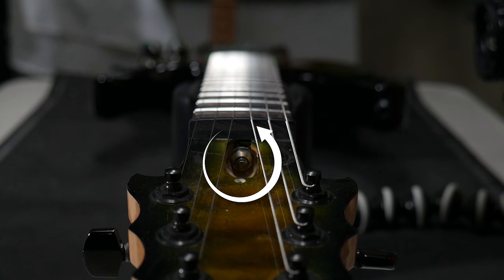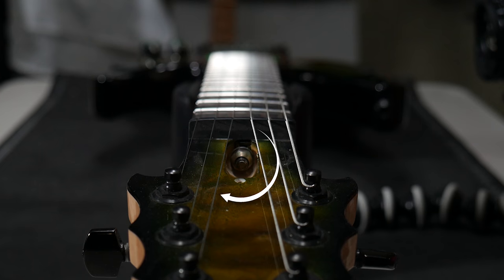All I really need to do is relieve tension, and it's as simple as turning this hex nut. To relieve tension, you go counterclockwise — lefty loosey, as they say. If you want to add tension, you go clockwise — righty tighty. So in this case, I'm going to go counterclockwise to relieve tension. I'll turn it in about one-eighth to one-quarter turns and see how it adjusts.